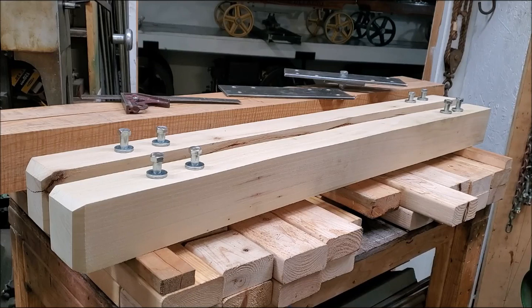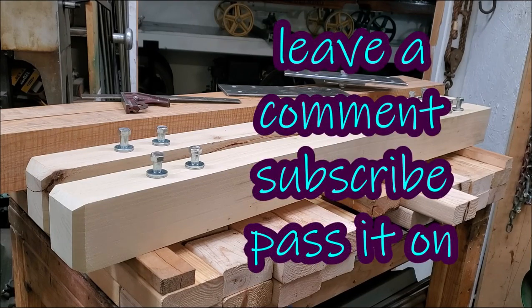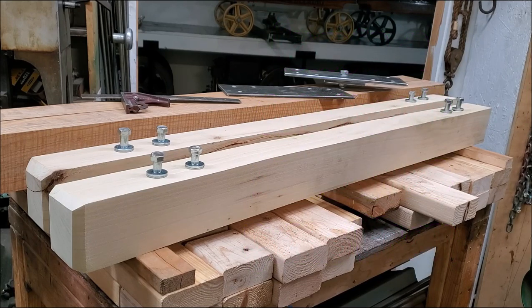I'll tell you about them two skid runners — we'll have to cut them to size, drill a bolt pattern, let's get that done. Cast iron wheels, roller bearings. That's that 36-grit right there on that orbital sander. 36 — just knocked it down, beveled the ends off, holes drilled, and we'll get some stain on that tomorrow. We'll be right back.